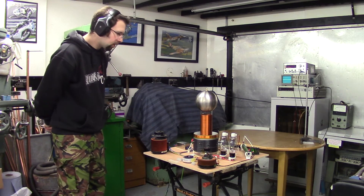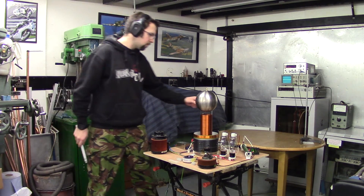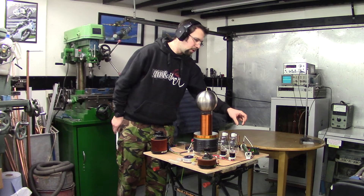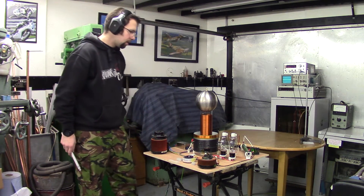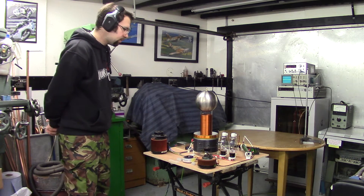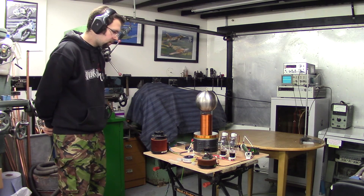The staccato will be the way to go really, because that'll take the duty cycle down quite a bit. I can already do that with this little resistor here — if I was to make that a variable resistor, then I can change the duty cycle a little bit with the grid timing on that. But the staccato is pretty much the way to go. I can do it electronically now with the staccato, just waiting for the triac to get here, then that'll be interesting — I can start running that.